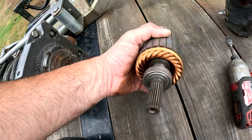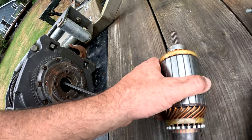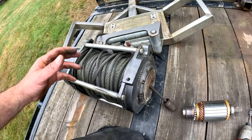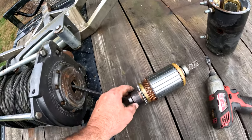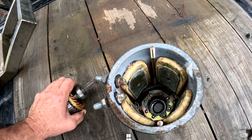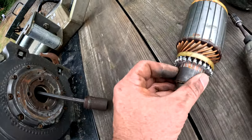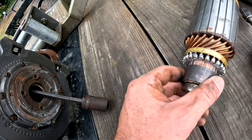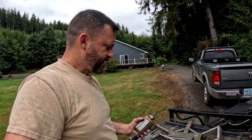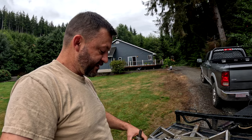It took me a minute to wrangle this bearing out of here, but yeah, this is it. This winch sits out on my trailer all the time, and I do have a cover for it, so the motor and everything is under cover. But the rotor itself looks fine — it's the commutator. I think probably what happened is one brush got stuck in there, and high amounts of current were flowing through there, heating it up. I'm not even going to try and fix this. I could probably unstick these brushes, but I've never really been happy with this motor anyway, so I'm just going to pony up the extra $150 and get a genuine Warn one.